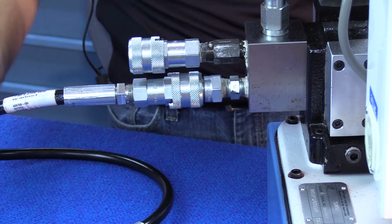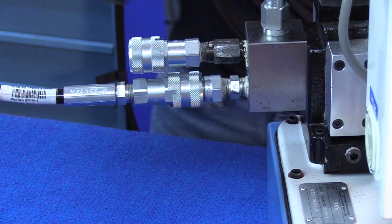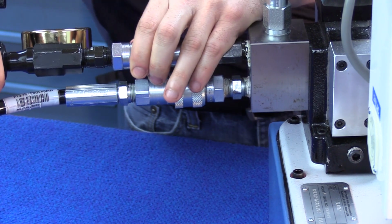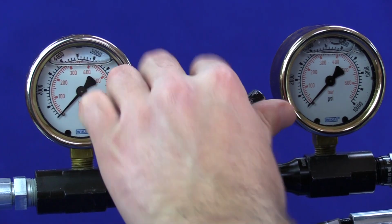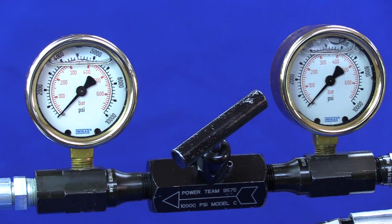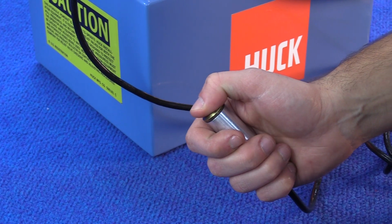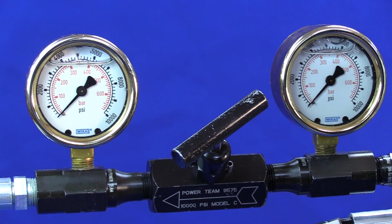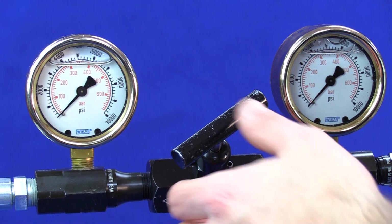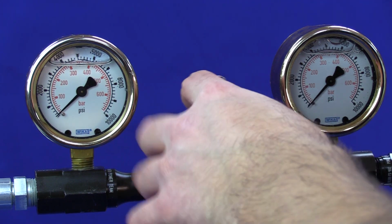When you first start up a 940, you should hook up a T124833CE pressure gauge. Leave it in the open position. Use an auxiliary trigger. Activate the rig. At this point, we're just allowing fluid to flow through the rig and to bleed the unit.